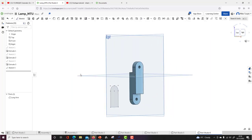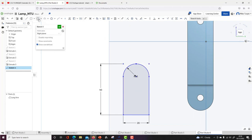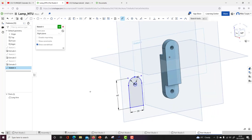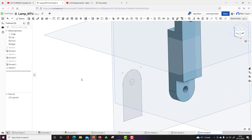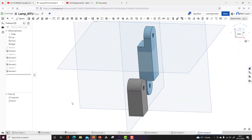Apply 10mm fillets to all corners, green tick. This time instead of drawing the hole separately, let's put it in the sketch now. Go back into the sketch, press N for normal, use the circle tool, place it, and dimension it to 5mm — we're using standard 5mm metric components, probably socket head screws. Green tick. Now when I extrude it 16mm, it already has the hole in it — that's a nice way to save the separate hole-alignment step.